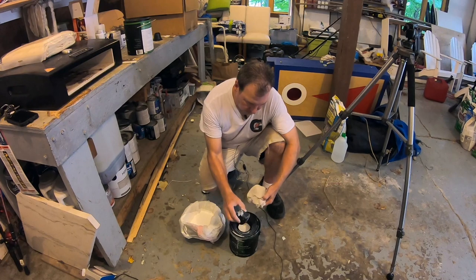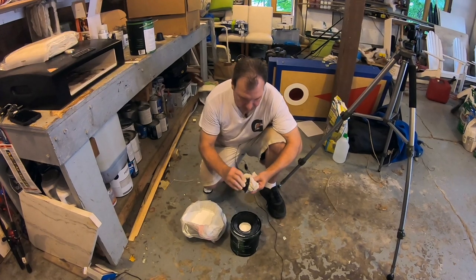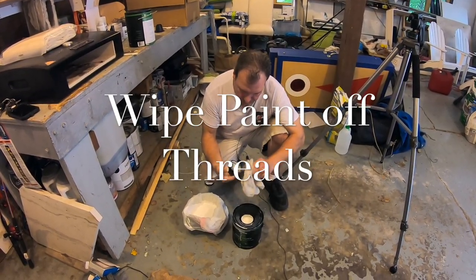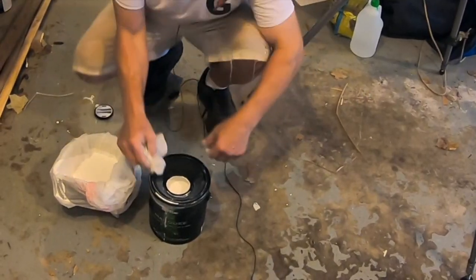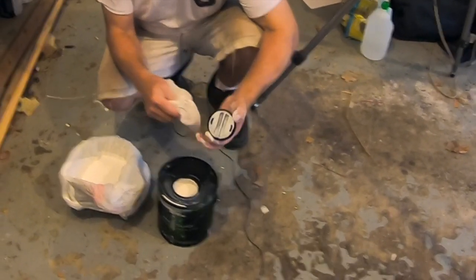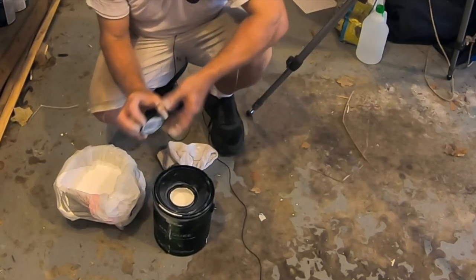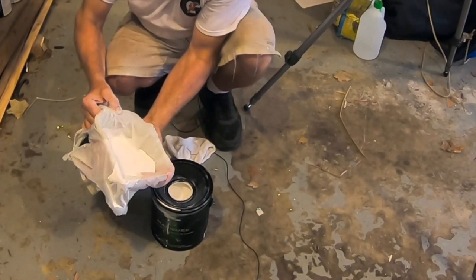When you're all done painting, unscrew the little spout and get all the paint off the threads — that's tip number three: remove all the paint from the threads so you can use the spout again. The real key is to make sure all the paint is off here, and also on the smaller lid. Remove all the paint from there, because otherwise the next time you go to paint, it'll be next to impossible to get the lid off.